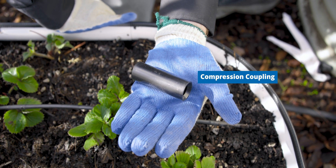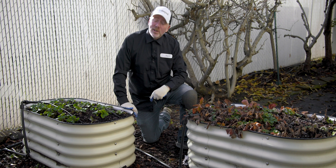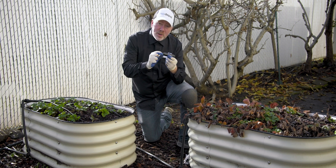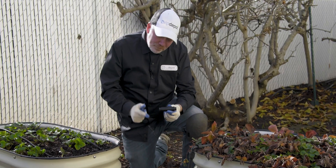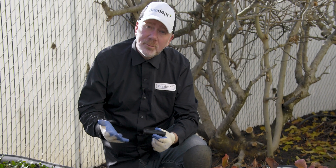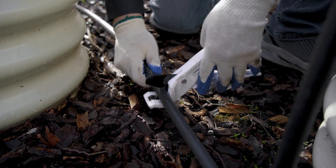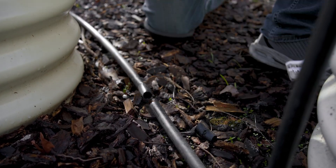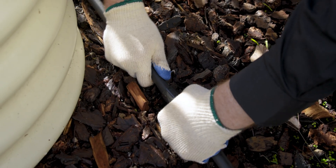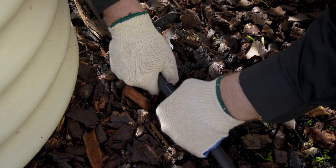Let's move on to compression fittings. The biggest downside to compression fittings is they're not reusable, but the upside is they're among the cheapest ways to fix your irrigation lines. The reason they're not reusable is because there's a compression ring inside that grips onto the tubing, making it very difficult to get out. While technically you could cut away the tubing or pull it out, the compression ring's integrity would be compromised, and when it comes to irrigation it's just not worth the risk. To install, cut out the damaged portion just like you would with any other fitting, then push the tubing into the end of the fitting. Be warned — it will take a lot of elbow grease. There is a trick behind using compression fittings: while applying pressure, quickly walk the tubing back and forth to help insert it into the compression ring.